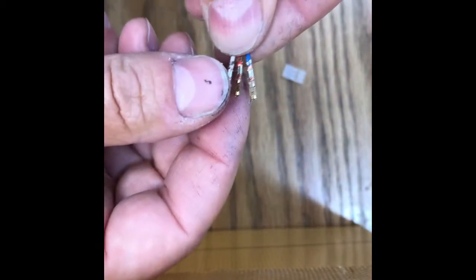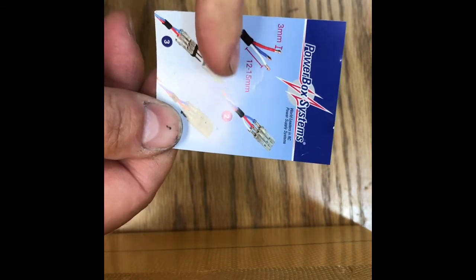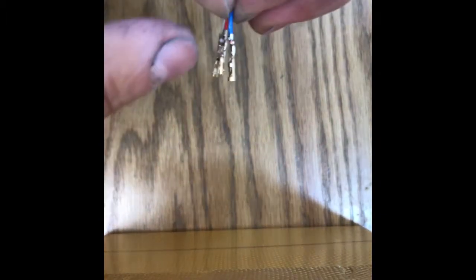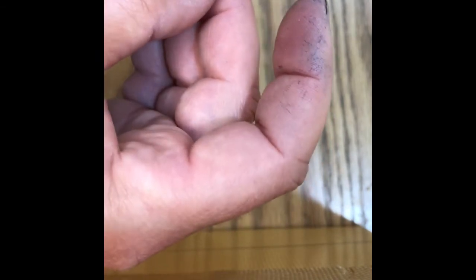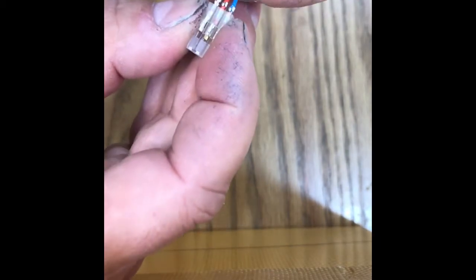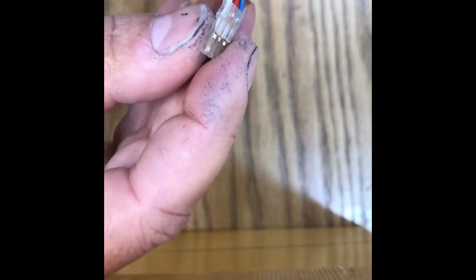Now that we have all the pins on, we want to put the wire in the right order — it's blue, red, and white. The sheet they give you is really nice because it shows you: step one, strip the wire; step two, put the pins on; and now step three, slide them into the housing. Make sure the little tab on the piece goes to the top — you can see the indent here, this piece catches the tab, and the flat side goes in the bottom. In the connector itself you can see the holes — hold those up, wiggle them in there and make sure they don't turn, then click right in. You can see the little tabs on top are grabbed.